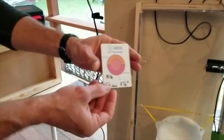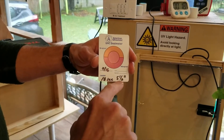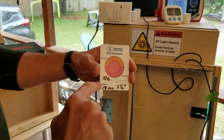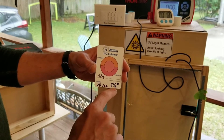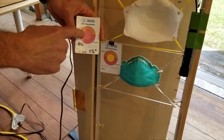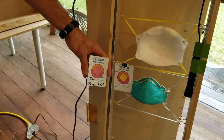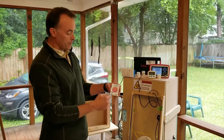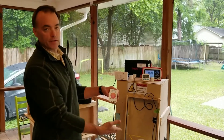This is a card that we put in this box a couple days ago. You can see we mark the date, the exposure time, and the distance in inches that the card was from our UVC bulb. On April 16th we placed this card five and a half inches away from our bulb, just like our PPE is positioned. We exposed it for 18 seconds and you can see the interior of the card goes from the original yellow to pink, indicating we exposed it to 100 millijoules of UVC radiation. Based on our calculated cook times from our radiometer, we calculated we would need 18 seconds to hit this level of exposure. This card confirms that.